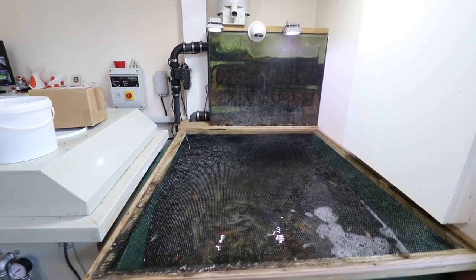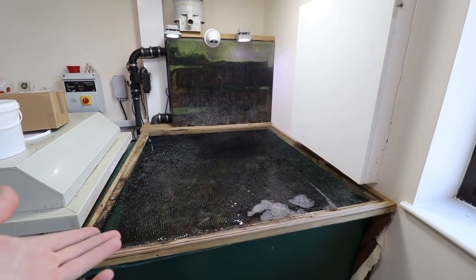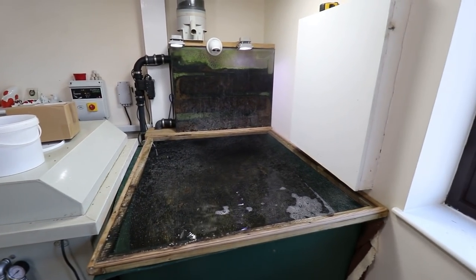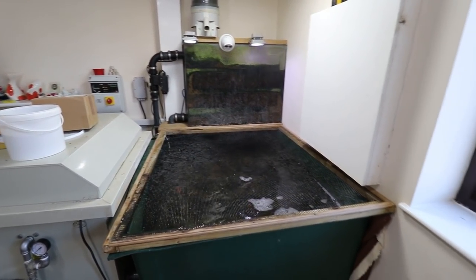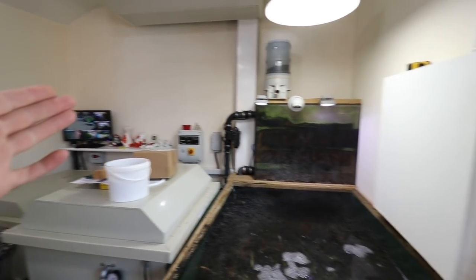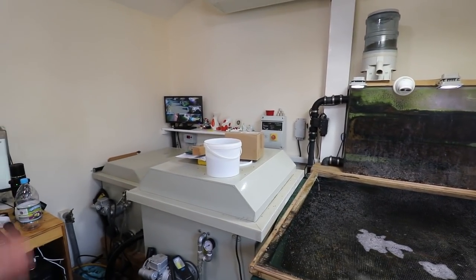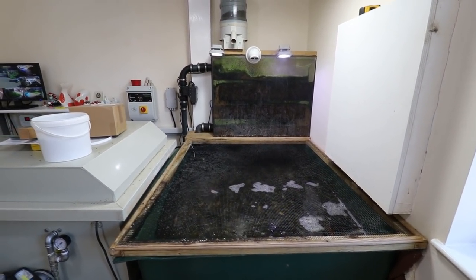One of the advantages is this pond was at 26 degrees and all I did was set it to 18 degrees and left it. I didn't have to go down a little bit at a time - it does it itself. It kept the heater on and every day it basically dropped a degree or so until it got down to 18 degrees. You just put in your desired temperature and it gets there in small increments.